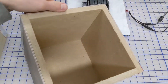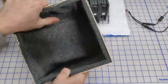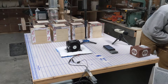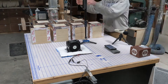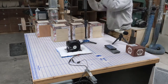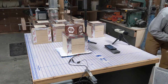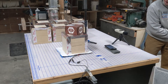Once all the boxes were built, I had seven boxes total — one control with bare plywood and six lined with different materials. My first measurement was to place the entire box over the fan and see how much noise it was producing, basically testing the sound absorption capability of each material. I placed a thin piece of slate on the workbench around the fans and put a box of screws on top to make sure I had consistent down pressure on each sample.